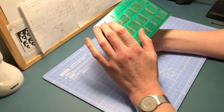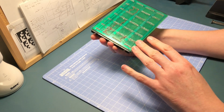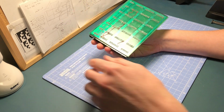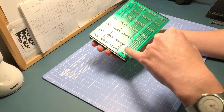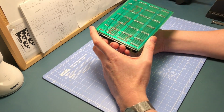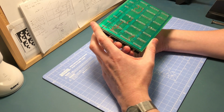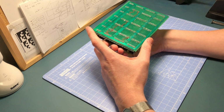Because now all the components are in, this green solder mask will have hardened quite well, so it's going to be very hard to solder through. But that's fine, because everything I need to do now is going to be about either remelting these joints or putting some jumper wires over. So soldering is a mess, and I think the thing I've definitely spotted is that I needed to have the iron on a higher temperature. 350 degrees centigrade in the end was probably the best temperature.